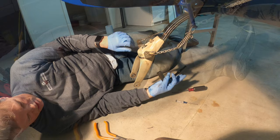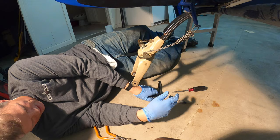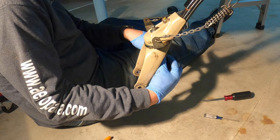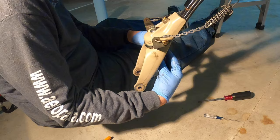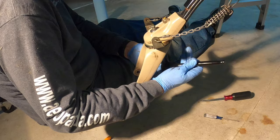Here's where we are — we're looking at the breakaway. It's a little loose, so what we're going to do is tighten it up until it bottoms out and count where we are. It's a half turn before it bottoms out — not bad. If it's fully tightened it doesn't move at all. Actually a half turn is where I normally start on these, so we're not too far from where we want to be. We're going to go one half of a turn and test that.